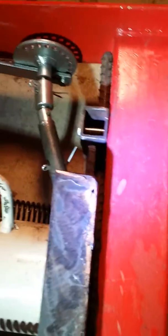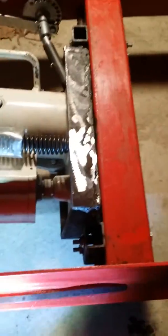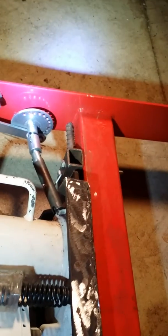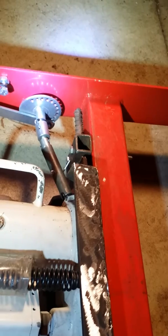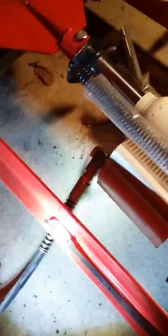It's a rebar held together by inch and an eighth inch square tubing that I drilled holes through. I cut out a little passageway there for the rebar to go through so that the jack can tilt — it kind of teeters on that crossmember. I got the hinge part about a third of the way up from the bottom, which gives me the correct angle and height adjustment.